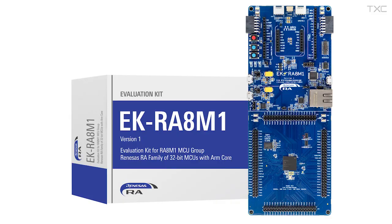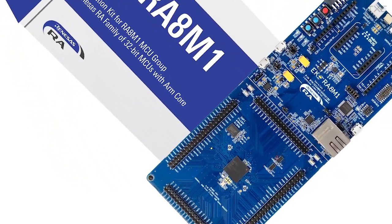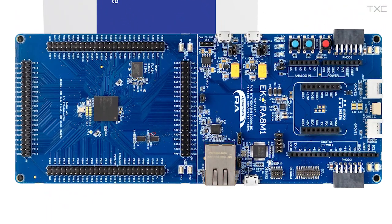Renesas also provides middleware stacks, wireless networking stacks, and crypto APIs required for secure applications. On the tooling side, there is a comprehensive set of debuggers, compilers, and IDEs. Renesas has worked with all tool vendors and ecosystem partners to integrate Cortex-M85 and Helium support — including Helium intrinsics and auto-vectorization — to enable performance uplift for customer applications. The RA8 M1 evaluation kit exposes all functionality on the chip with native pin access and external memory for high-performance application development.